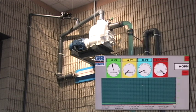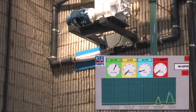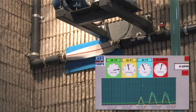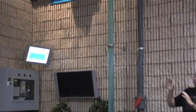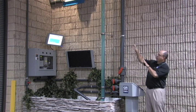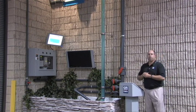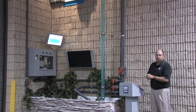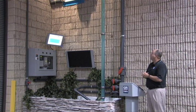We'll run through a couple of cycles. If you're in a situation where you're pumping water up a high hill or in a high head application, you've probably been in a pump station where you're pushing the water up the hill, you shut the pump off, the water starts rushing back to the pump station, check valves start slamming, header piping starts moving around — and again, this is only a 15 horsepower application that we're looking at right here. So there's no control with an across-the-line starter. It's full-on, full-off, you take what you get, and sometimes it causes a lot of issues with header piping and check valve slamming.